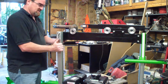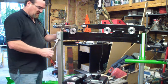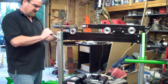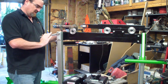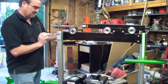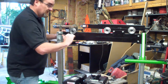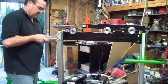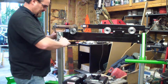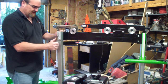If there's any kind of looseness up here on this structure that holds the weight of the unit — probably a long shot — but if it gets off any it's going to mess up the cut, and I don't need that. I want a saw that has repeatable cuts. I'm not sure how much I want to go by that scale. Once I calibrate it and actually get to where I can trust it — if not, three cranks is a half inch, and I'll calibrate that way.